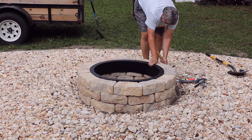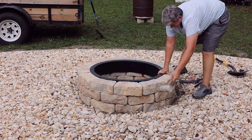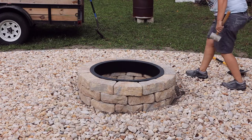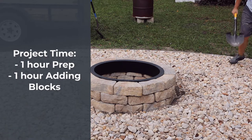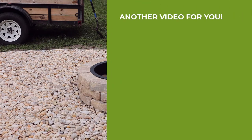The glue is key to keeping everything together rather than just loose-laying blocks. If you want your blocks to last longer, you can line fire bricks around the bottom of your pit where the paver blocks are exposed to high heat, or install lava rock at the bottom as well. All in all, this project took about an hour from placing the first block, with site prep taking about another half hour. It may take a bit longer if you're removing grass. Make sure you watch the next video where we walk through how to install river rock around your fire pit area.